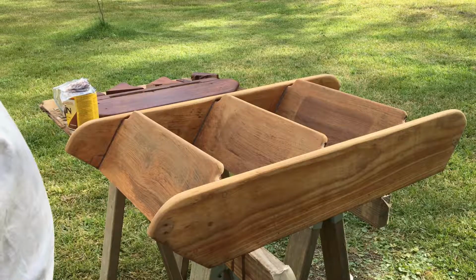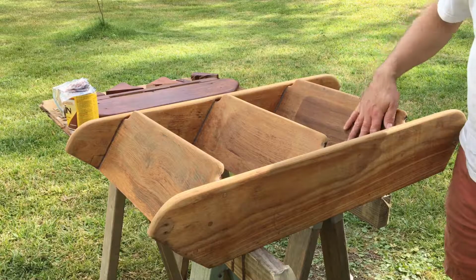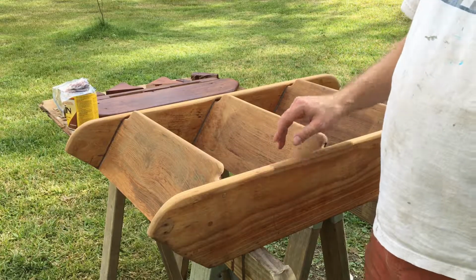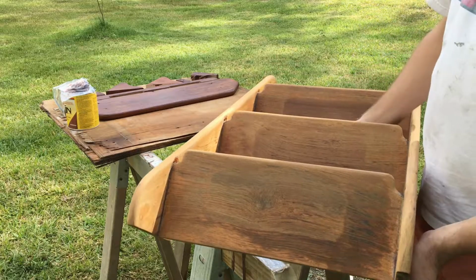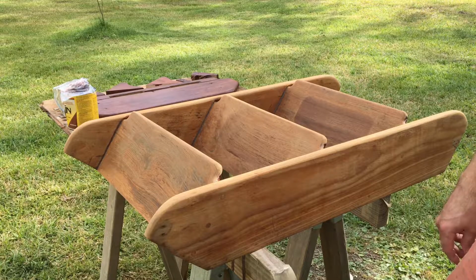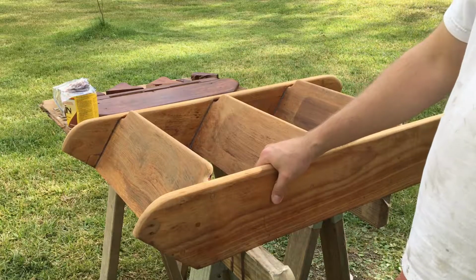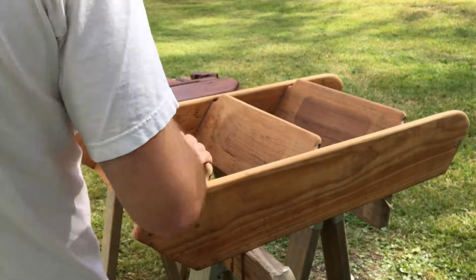Okay, so these are our stairs, the actual upper ladder stairs. Anyway, when I sanded the other day, like I said before, they were exposed on the top of the treads to rot. I mean, you can see where the wear is just eating away at the wood. But we're going to stain and reseal these so that we don't have the possibility of it deteriorating more over time. We want to preserve as much as we can here, and also keep the color from the other stairs that we did. So what I'll do is gel stain these next.